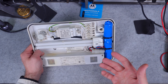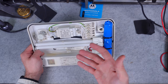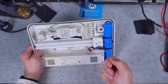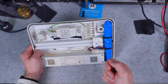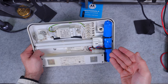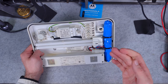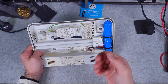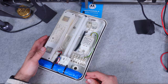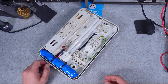It is extremely important to have those two contacts shorted in order to activate your light, but you can dedicate a separate switch that allows you to turn it off when you don't need it and wait until dark to re-enable it. It should be constantly on so the lamp trips into emergency mode. We are going to wire those two pins — A and B — together.